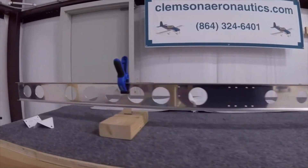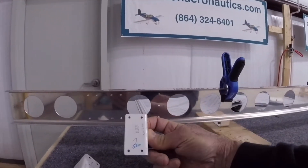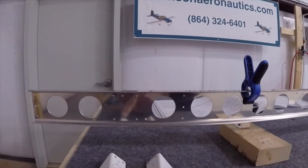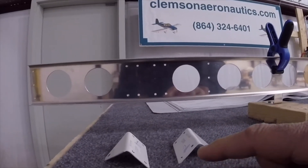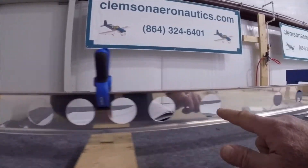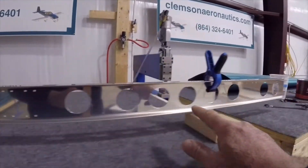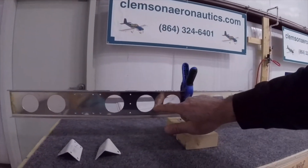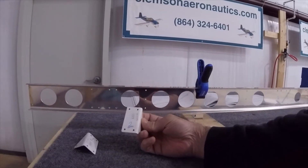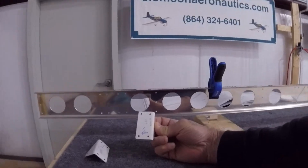The other thing — I marked my hinges: one, two, three, four, and so on, up through the eighth. It's not critically important on the spar itself because I know the orientation, but I could mix these up. So I marked them and I'm not going to scuff these markings, so I won't lose orientation on those parts. This is important so we can put each hinge back in the same spot after we do the match drilling, and after painting with the primer and so forth.